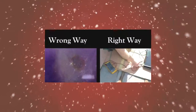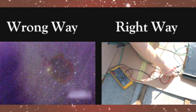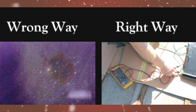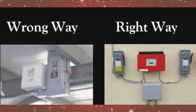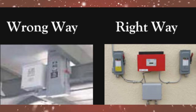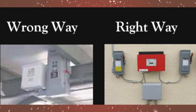Test your panel frequently. Testing your panels as they are installed allows for isolating problem panels and troubleshooting the overall system. A non-functioning panel might as well be constantly facing the night sky. You need to be able to disconnect each piece of serviceable equipment in the PV system, such as arrays and inverters. In simple systems, there will be a DC disconnect between the solar panels and the inverters, and an AC disconnect between the inverters and the panel.